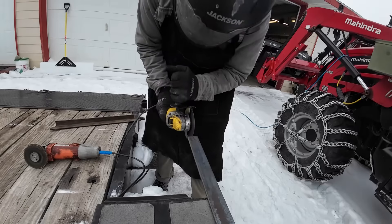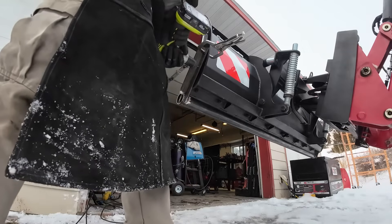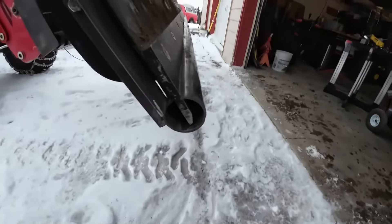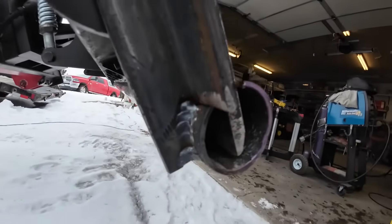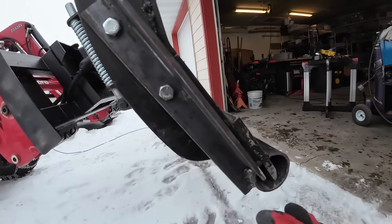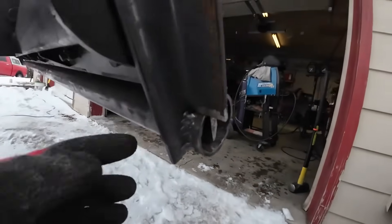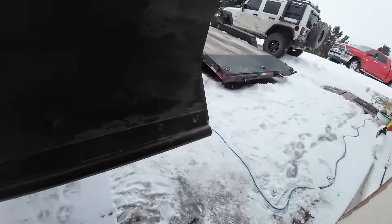Here's what it looks like. It looks like it's not touching right there, but it is inside — I guess that outer edge is worn a little bit. This is going to be the weak link — the welds. I got it welded on the inside and the outside, but I think that's going to be the weak spot. So if I hit something and this tends to rock, the hope was that two bolts here would keep this from rocking and keep it from pushing up. This will also keep it from falling off or sliding too much sideways. This is angle iron, but I don't really have the angle welded onto it. I may end up gusseting it in here somehow. We'll just see how this goes — if I bend it I can always bend it back and fix it, but it might work. It might just hold.